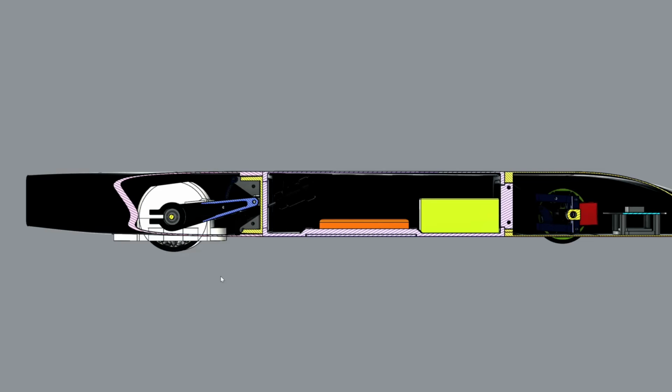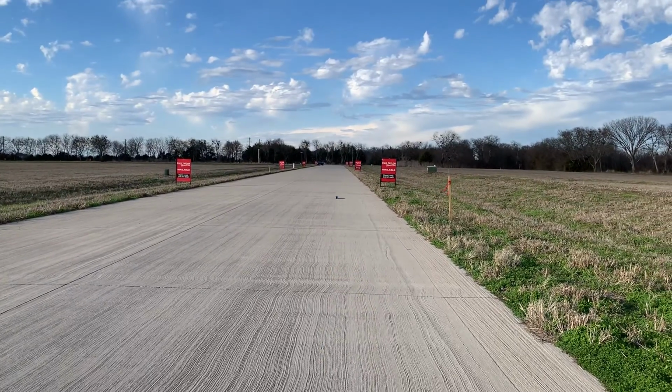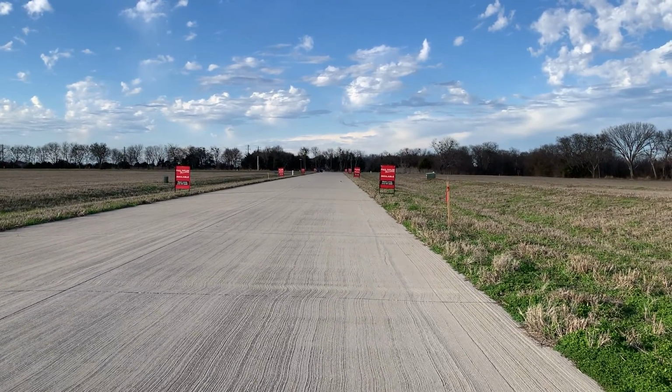So as I talked about in the last video, I was facing a lot of challenges around the braking configuration. The rear wheel doing all the braking and accelerating is definitely a trick, particularly braking, which is rather abrupt based on how this ESC works, and it's destabilizing the entire chassis. So because the accelerometer itself is directly in line with the rear wheel, I don't need, like a typical car would have, wheel speed sensors. I can actually use the accelerometer data directly to sense whether or not the rear wheel is locking up.